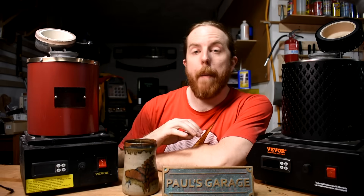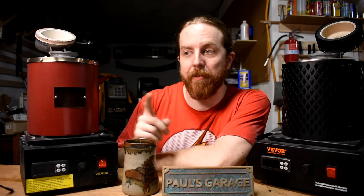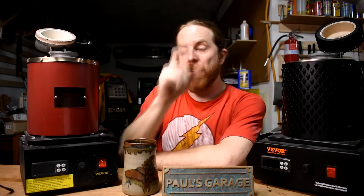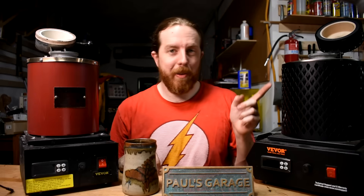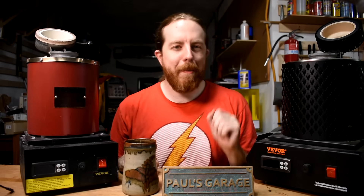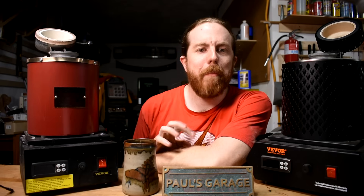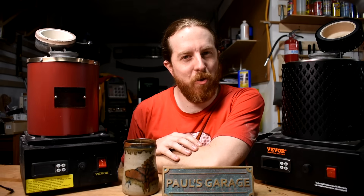Fourth: maybe the crucible got bumped. These things are not very tough. I've heard from a couple of you who have had crucible failures with these. One person mentioned multiple times that he thinks he slammed it into the thermocouple when loading the crucible, or dropping chunks of metal in — there's a drop and it hits the bottom. He suspects that may have contributed. I am usually fairly careful about not hitting that thermocouple, but he might be onto something. I store these crucibles on the ground under a shelf, and now and then I find a couple of them laying down. Maybe I knocked this one over before I used it.